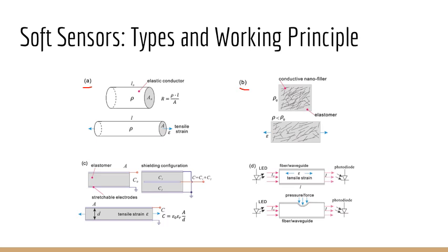Similarly, you have elastomeric composites where, along with the geometric effect, you also have a change in conductivity itself because of the movement of particles inside the elastomer. Then you have capacitive type sensors, where the geometric changes cause a change in capacitance instead of resistance — making them more ideal for contact localization and force sensing. And then you have optic-based strain sensors, where an applied strain causes a change in light intensity. Although they have different working principles, the challenges that all of these soft strain sensors face are the same.